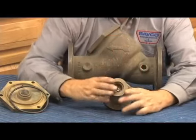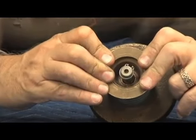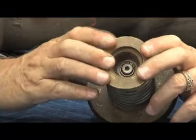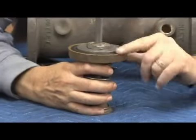So if you have to replace that spring clip, that's what that little part here is showing you, that clip right there. And make sure it's put in the correct way so the sharp edge is pushing with the force load, not the rounded side, because if it's the rounded side, it'll push and come right off. Okay. So normal repair, we don't have to worry about that though.